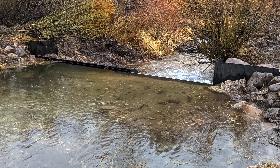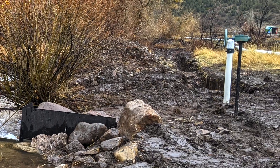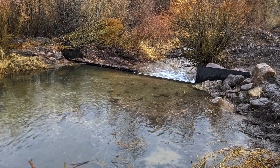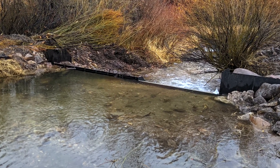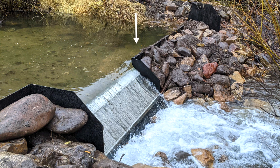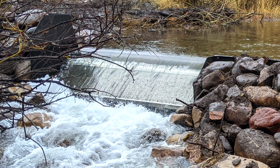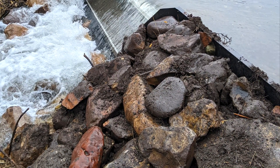With the stream flowing fully over the Coanda screen, the 12 inch valve and an air vent have been installed. The diversion wall's design was planned for a potential future flood stage of up to 100 cubic feet per second. In that case, the water will flow over the remainder of the wall and still permit the diversion via the Coanda screen. Heavy rocks have been placed in the flood section to ensure that they won't be washed downstream.